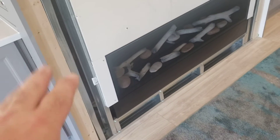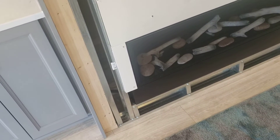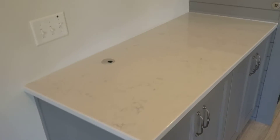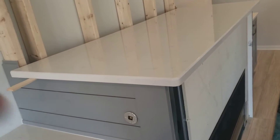Fireplace insert has non-combustible surfaces all around it and the fill-in here will be with some more half-inch, probably the Dura-Rock or underlayment board on the face of it. Now the left-hand side, same thing. Got all the cabinets in, all the moldings, all the quarter rounds are in, top pieces are in, and then we got all of our scribes and stuff up against the box.